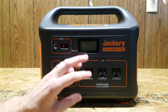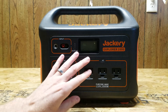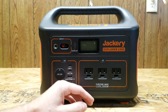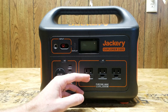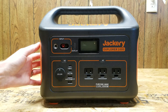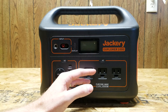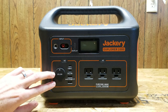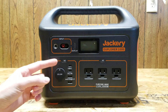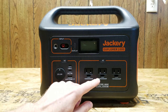This test finished at right around 820 watt-hours of power. I did expect a little more, but with a 1002 watt-hour battery you have to factor in the efficiency of the inverter. There's no indication in the manual what the efficiency is, but my guess would be anywhere between 85 to 90 percent. Additionally, the fan was running almost the entire time cooling the unit down, which was also consuming power. If you were to utilize the DC port you'd see much better efficiency, since the internal DC-DC converter is significantly more efficient than the AC conversion.